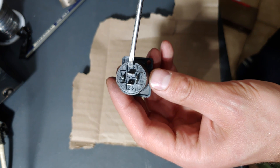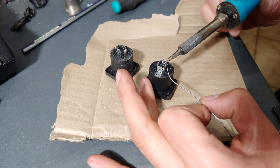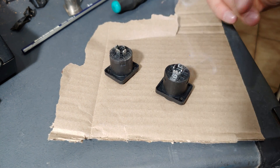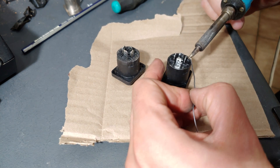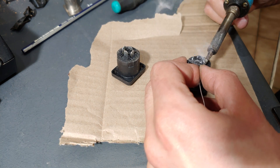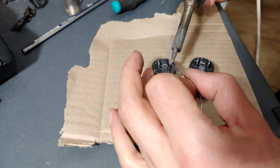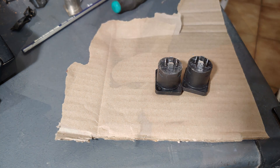It's going to be two wires: one-plus and one-minus. My advice is to tin the terminal before you bring the wires — it's much easier to work with a terminal that already has solder on 1-plus and 1-minus. Don't hold the soldering iron there for too long as it'll melt the plastic — no longer than five seconds: one, two, three, four — less than five seconds. There you go.